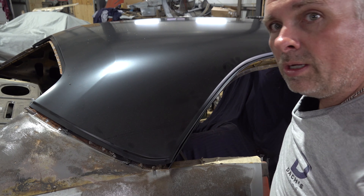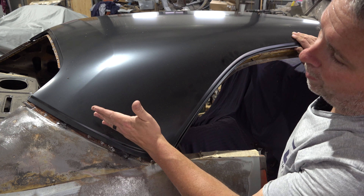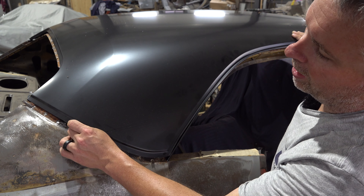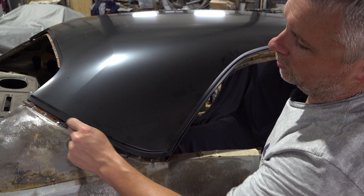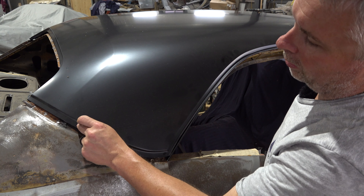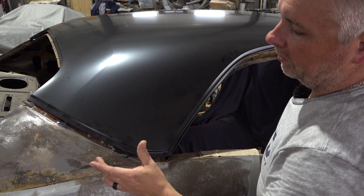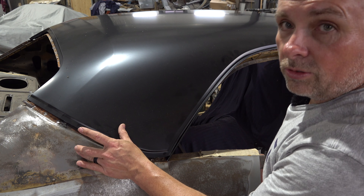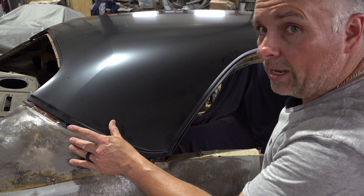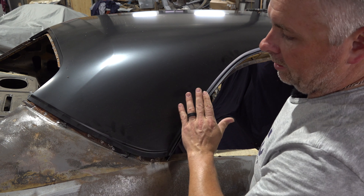There's a little tail back here we'll see what we do with the tail. The good thing is this whole panel goes back about another half inch to five-eighths of an inch. You can see where I dug out the old spot welds, and that's going to leave us with this area here — I'll do my welds and that'll have to throw in some filler. That's going to be under the vinyl, so I'm not too opposed to using filler as opposed to lead work because we're not going to see any of this ever again.